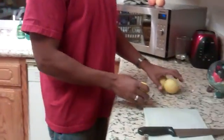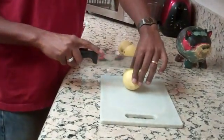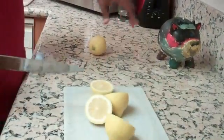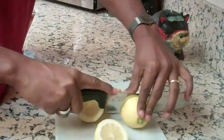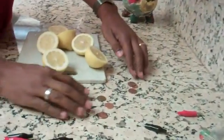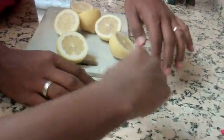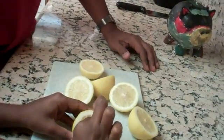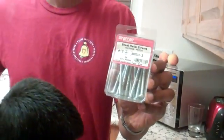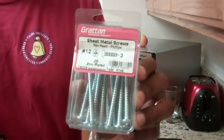Here we have three lemons. I'm going to cut these up. One, two, three, four, five, six. Alright. Now here we have six pennies. We are going to stick one into each like this. These pennies are copper plated. Even if you get squirted like I just did. And these are zinc plated screws — very important. They have to be zinc plated for this to work. So while you guys are putting the pennies in, I'm going to put the screws in.